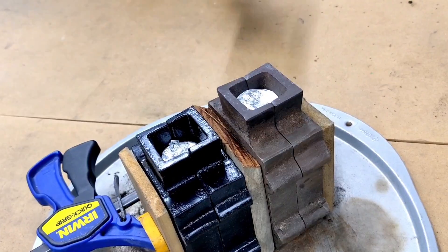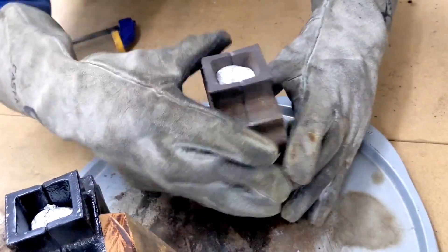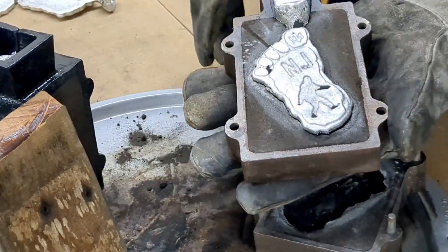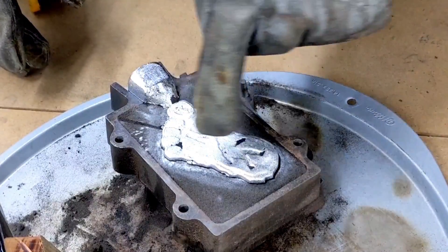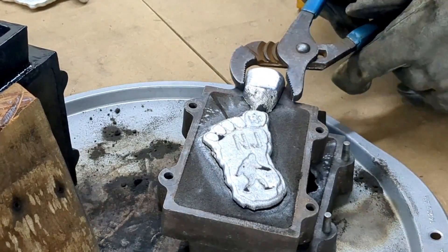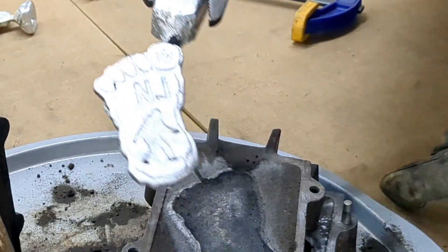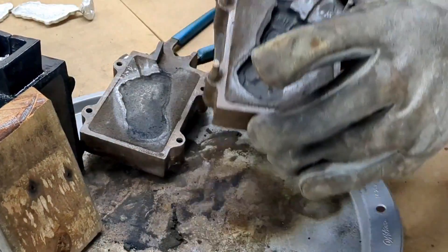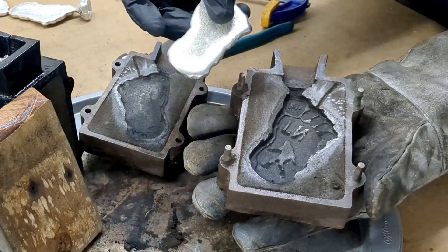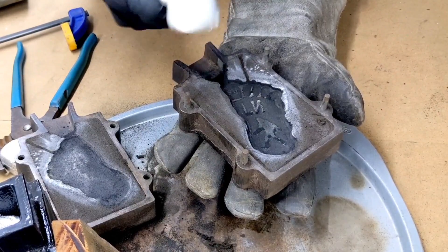I hope these are going to be better than that one and I hope I'd have a lot less cleanup. Oh look at that — it looks like there's a lot less cleanup. Do you see that ridge around it? That's like a perfect cast, except for a little bit right there and a little here. When I had the pattern in there, I just carved out a ridge on the outside to take away that impression or depression. So now I have an exact replica of this.